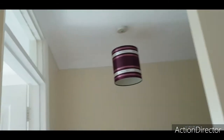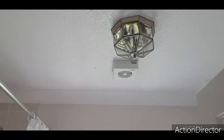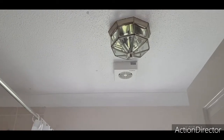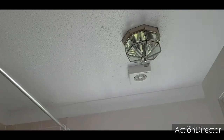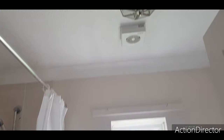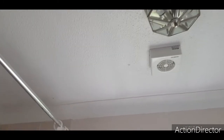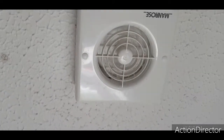How low do you go before it's classed as C2 on the flex and the pendants? A little bit exposed. That light fitting's not IP rated, but they've been changed to 4 JCC downlights because they're IP65, and it will do wonders in here. Like I say, extractor fans stay in for the minute. It's staying because there's no need to change it because it's pretty much new. It just needs a wipe, but it works.